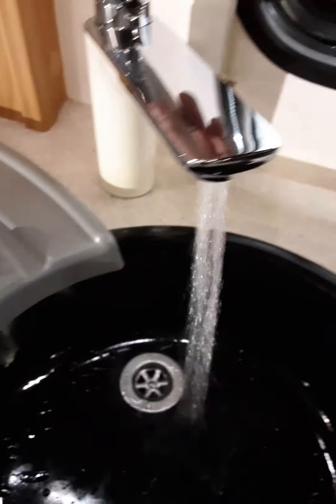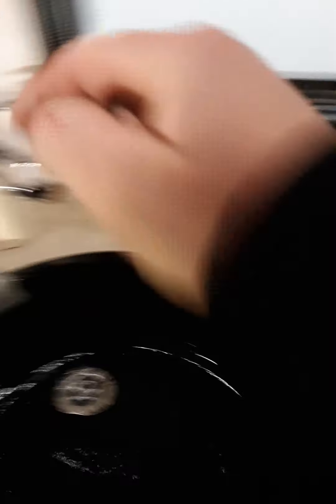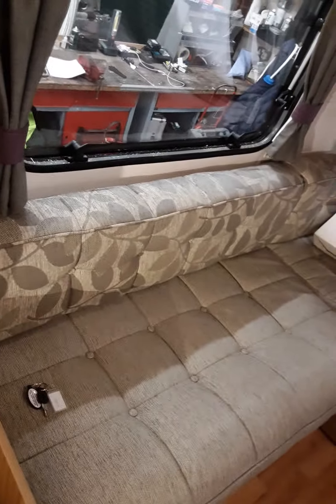The pump switch — when you turn that on, just make sure it is in the horizontal position so the water doesn't get out of the bottom, and then you're able to open your tap. Obviously once you first open it after it's been drained, you need to let all the air out of the system — at this tap, and the two in the bathroom on the sink and the shower. Once all the air is out, your pump will cut in and out as it should. When the tap is open the pump cuts in and you'll see a red LED. When the pump cuts out, the red LED turns itself off.